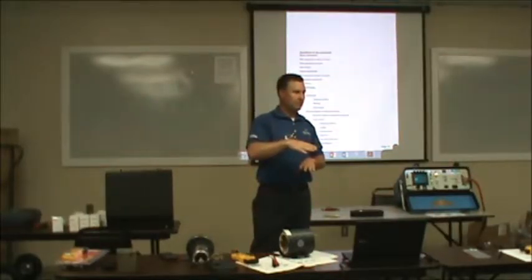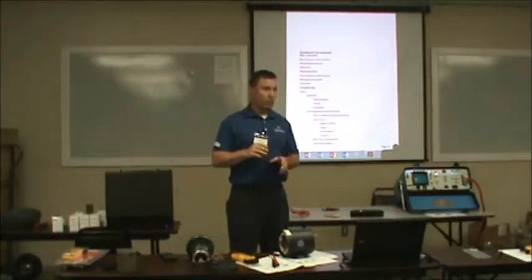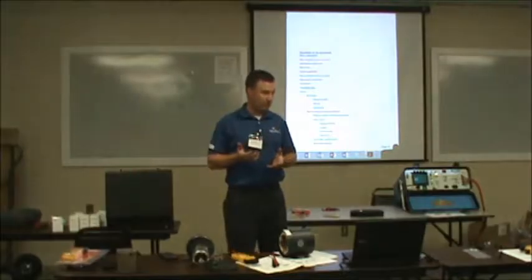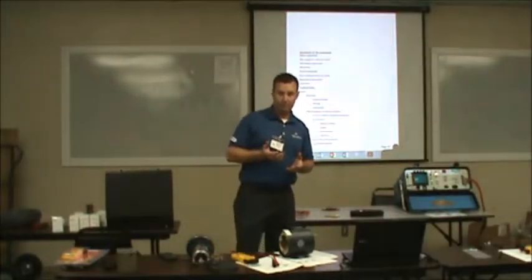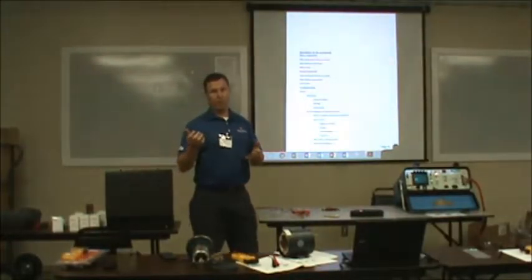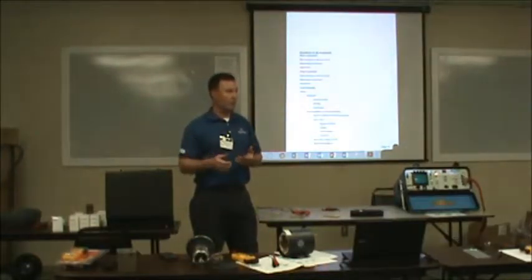Now you put the pump in, you put 85 foot of head on it, and your amps are going to come down. Now Greg has some pumps in Scottsville that have what we call high head impellers on them. They'll flat overload themselves if they don't have the proper head on them. I mean, when we run them in the tank, a 40 amp motor pulls 60 amps.